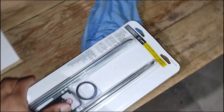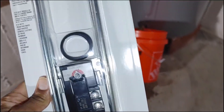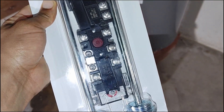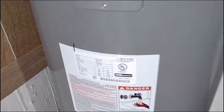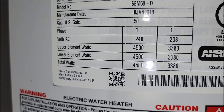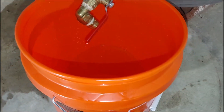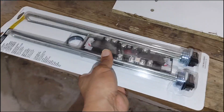Here's the kit I was talking about — it's made by Everbilt and I got it from Home Depot for about $28. I'll leave a link in the description below. It comes with two heating elements, two thermostats, and two gaskets. It's very important when choosing a heating element to make sure it is the same wattage as displayed on the water heater. Mine was 4500 watts, which is pretty standard, but still check that label — double check, triple check.